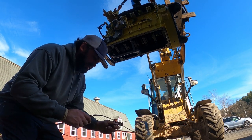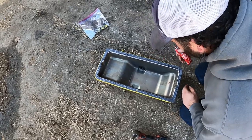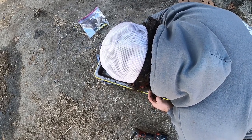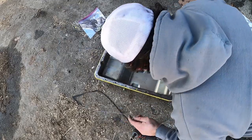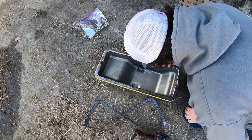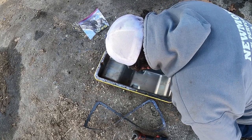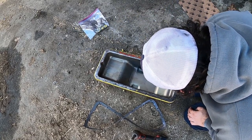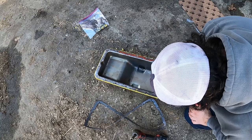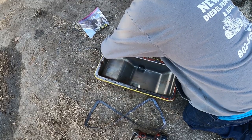It only goes one way, I think, here. So usually they got some silicone that they put on with it. I got some red RTV, which is high temp. I need to get some more of my good stuff, but we'll just put a thin layer on it, just extra protection. And this stuff is old. The gasket's gonna do what it does, but basically the silicone holds it in place a lot. It does prevent leaks if there's something weird about it. God, this thing is horrible.